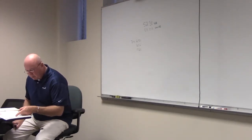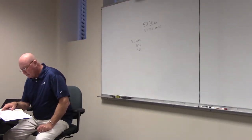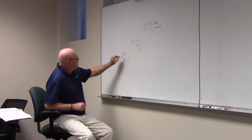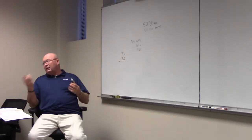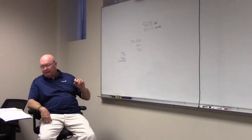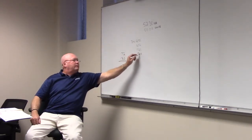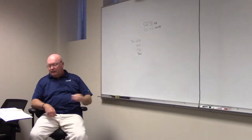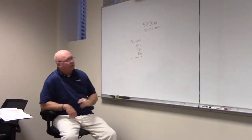Now one more. It says there is a blower. So that's a 1/3 horsepower. Let's stay right there where we're at. A 1/3 horsepower, 120 volts, is how many amps? 7.2. So now we got to get volt amps to that. This 7.2 times 120, which is how much? 864. Okay. All right. Now let's just add all these together. Let's go ahead and add all these up and see what we get.